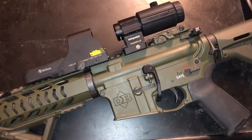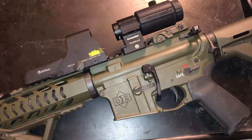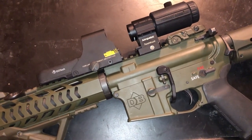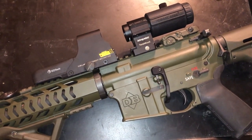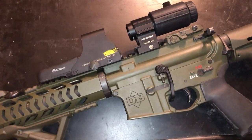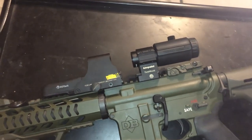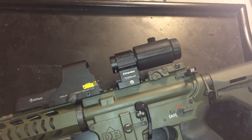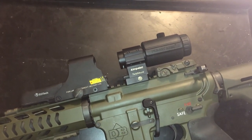But what we're going to do here is, because those two points normally have 5 to 7 pounds of friction, we are going to put all the friction on that point that you can put with a piece of string. And we're going to change that 5 or 7 pounds of friction into 30, 40, 50, 60. I can't tell you how much you actually exert on it. But what this is going to do is force these two places to polish themselves. And they're going to polish themselves to one another, which is perfect. And like I said, it's free. It doesn't cost you a dime.